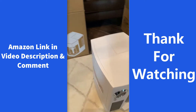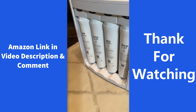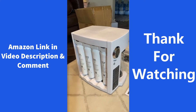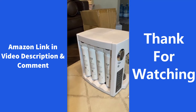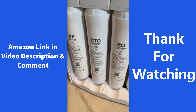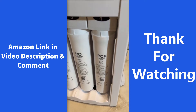If you look on this side, I was really impressed. For a space-saving size, it really packs a punch on RO quality water. It's no longer than about 13–14 inches long and maybe about eight inches wide. You can see here we have a polypropylene filter, a coconut carbon block filter, a reverse osmosis membrane, and a post-carbon filter for taste.